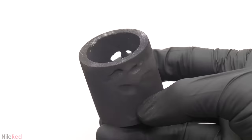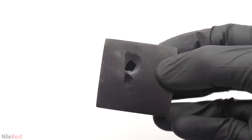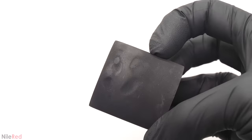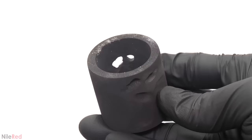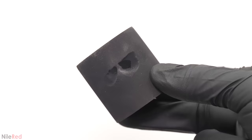When I took a look at it a few hours later, I noticed that there were some huge holes in the side of it, which were made by the torch flame. This is why you aren't supposed to use oxidizing torch flames on graphite for long periods of time. I was lucky it didn't end up being a problem, but it could have caused the crucible to break when I tried picking it up. This could have not only caused all the gold to spill everywhere, it also would have been a huge safety hazard.